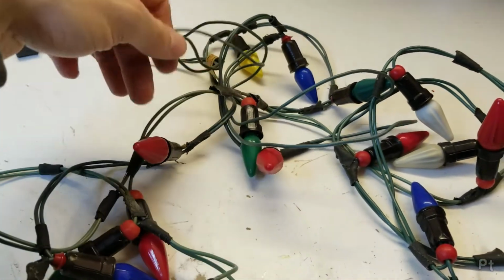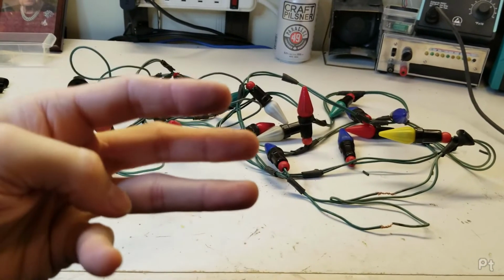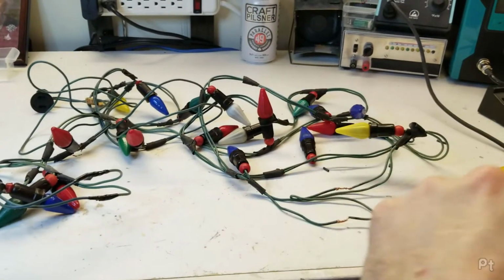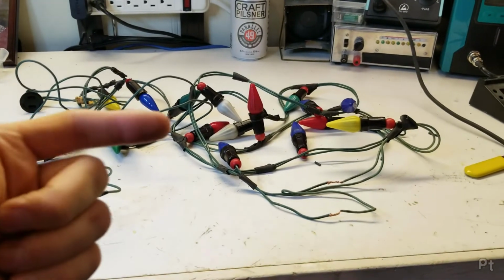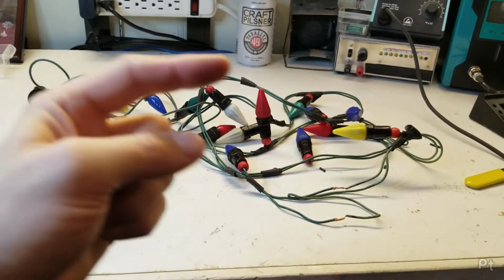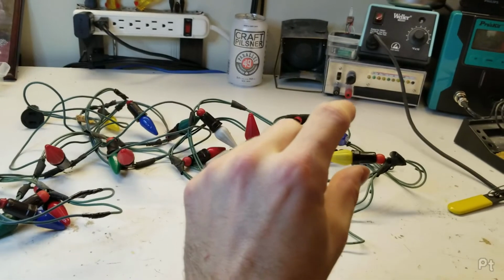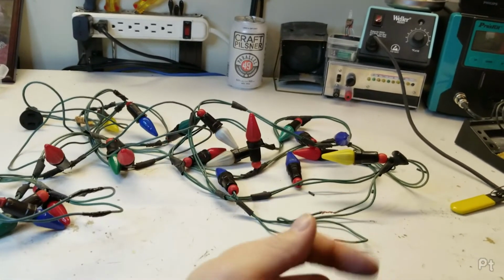There's no third wire. If you look at old mini lights, like a string of 50 mini lights, or fairy lights for those who call it that, they would often have 3 wires. And what that third wire is for: let's just say you have hot running through the lights and you have neutral running all the way to the end to complete the series circuit. So you have hot that goes into one light, comes out, so that's one wire. You have another wire that just runs all the way along as your neutral. Your third wire is a second hot. And the idea behind that is that it will provide hot power to the next set of lights. So you'll have series 25 lights for mini lights, then you'll have a little join and a splice, and you'll have the second set of 25 lights using that second hot. That way those are in parallel with the first set.